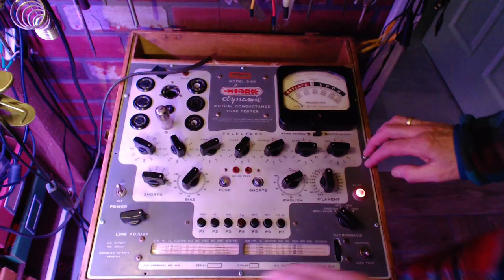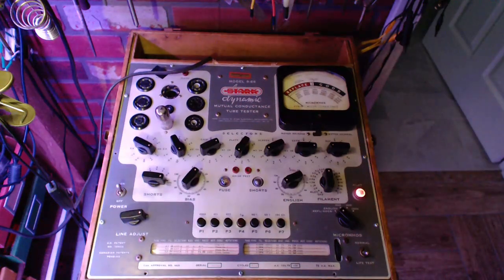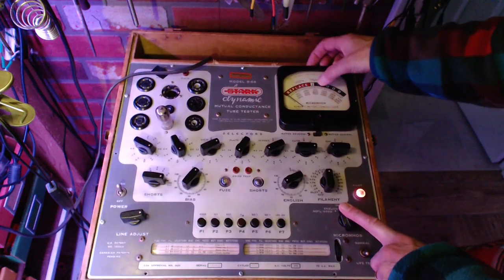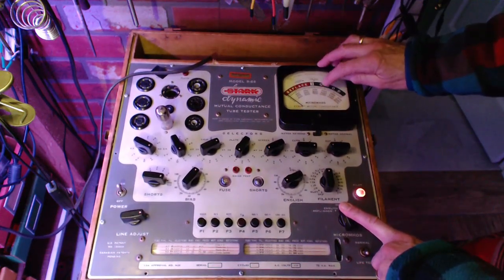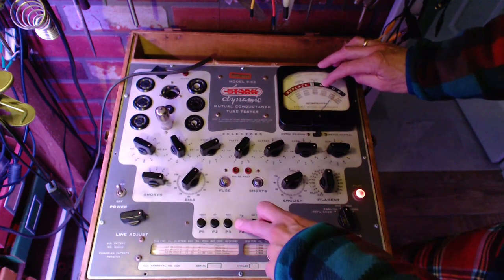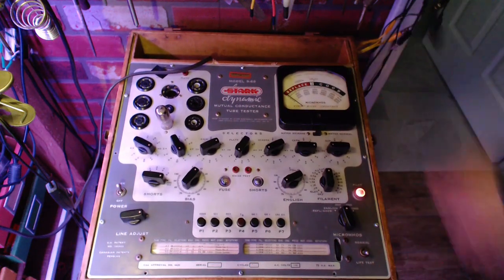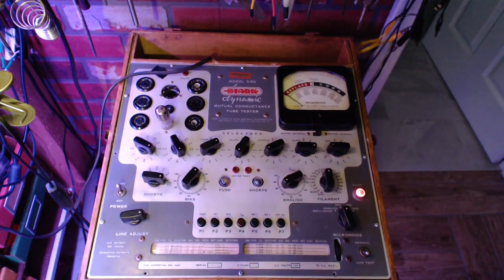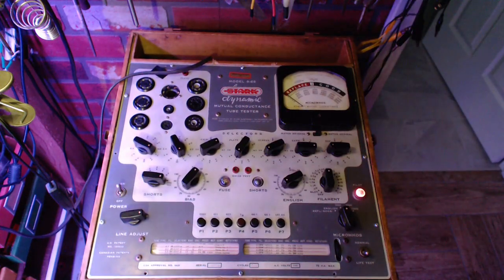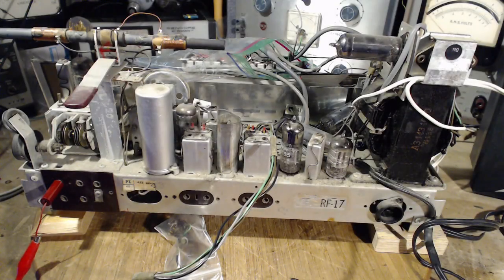Shorted. And I have to look over here on the special sheet. EF85 to 1890 is the reject point. So 3000 scale, 1890, coming up in this area here. Got to get above there. Ready? Holy smokes! That is a hot tube, EF85. Okay. So I can't expect any problems with that, realistically speaking. Okay, ready for the next tube.